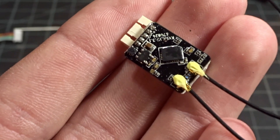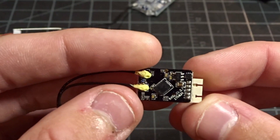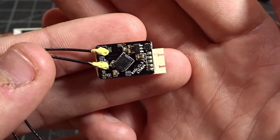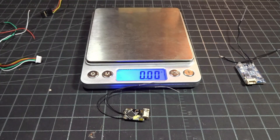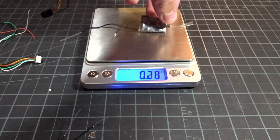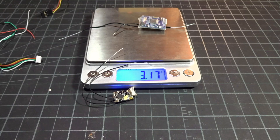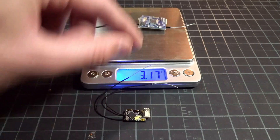There's just a look at some of the other electronics on the back. The plug is definitely the biggest thing on this, but if you wanted to, you could desolder it and direct-solder to the pads underneath — there is enough room. It's a super tiny receiver and does everything the XSR does. Before I get this installed, let me weigh it real quick — it weighs 1.1 grams, which is crazy light. The original XSR weighs 3.1 grams, so this is 2 grams lighter. It's weight savings, and the most important thing is size — you can fit this in places you couldn't fit the XSR.